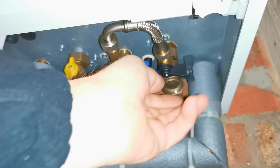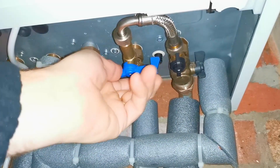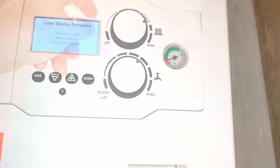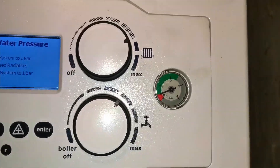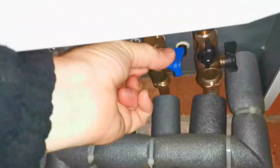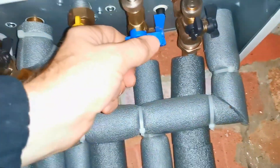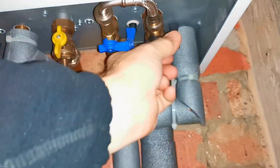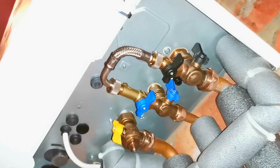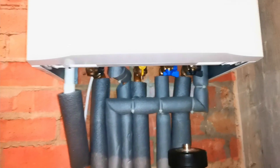Just to show you again with the valves in a different orientation: open one valve so it's in line with the pipe, then open the other valve. When you do that you'll hear some noise as the water starts going into the boiler. Keep an eye on the pressure, make sure we don't put too much water in it — keep your hand on the valve if necessary. You can tell valves are closed because the handles go across the valves; when the handles are in line with the pipes it means they are still open. Make sure the handles go across the valves to confirm they are closed.